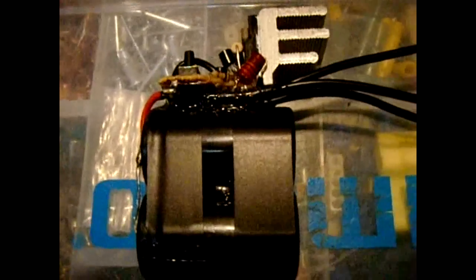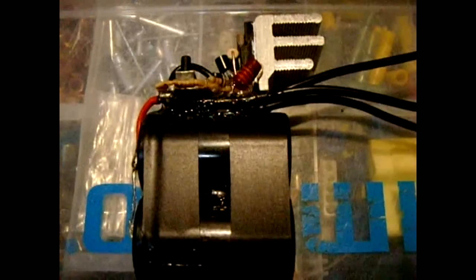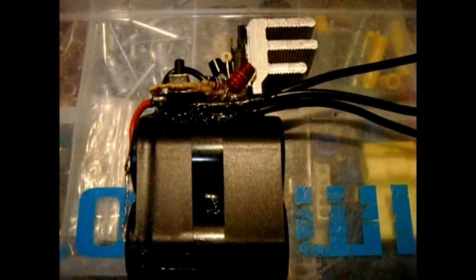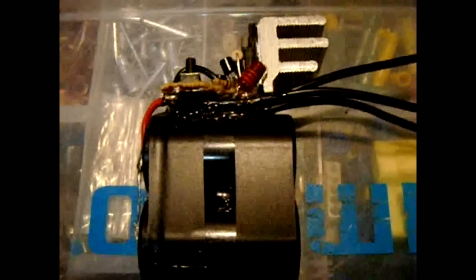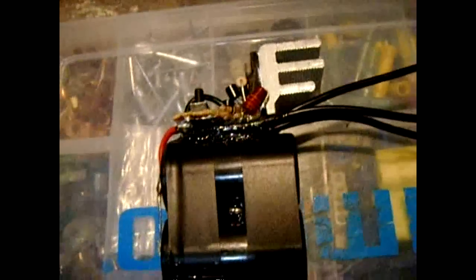But it's really good for small electric motors or lighting. Like a solar panel setup where you're charging up some battery bank, and then you get a couple of cloudy days where it's not charging and at night your batteries drain down. This will prevent those batteries from going way down and being damaged — it'll actually shut off. And then once it comes up charged again, you just push this button and the whole circuit's back to normal. Real handy circuit.